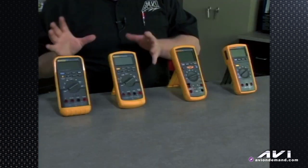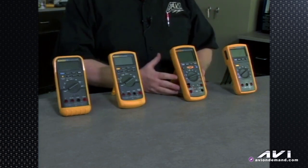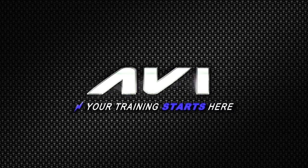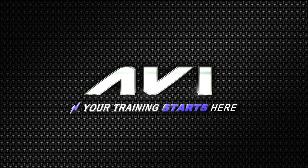That's a brief overview of the buttons, jacks, rotary knobs, and basic functions of several Fluke meters — from an old 87 3-series to the 5-series, to the new 1587 insulation tester and the Fluke 233 with a removable head. All of them have their purposes, and one of these is probably already in your toolbox. Now let's get busy with some bench work to really get into mastering your multimeter, then we'll go out to some vehicles and use it on the car so this tool becomes the most valuable one you own. Thank you for joining us.